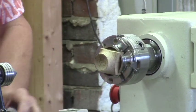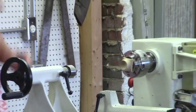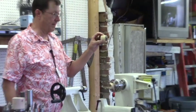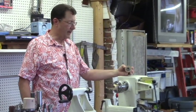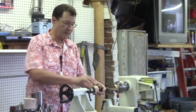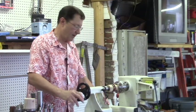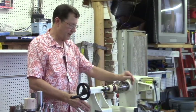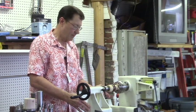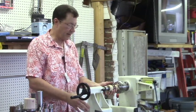I did have one other little semi-improvement on that ball holding technology there. Insert a bearing in the back of it, and it allows it to mate up with it and allows a little bit of swivel there, so you get lots of adjustability. And it just self-centers it, and it keeps you from... you could use it with a dead center, you know, up against that bearing.